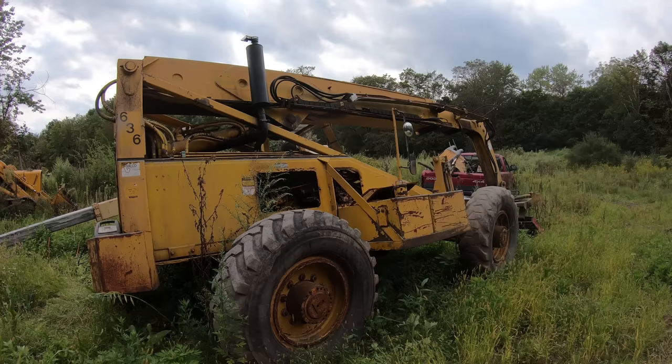And I'm going to do the same thing with that boss right there. Because again, this is the same situation. These are bosses, so the pin should never move inside of them. It should only move where there's nothing there right now, right there. The cylinder moves on the pin. So there's three bosses because there's two on the outside and then one in the middle.